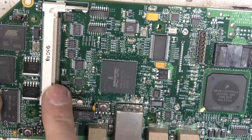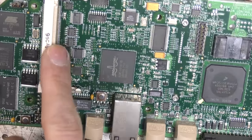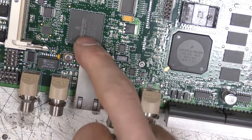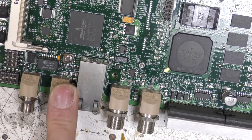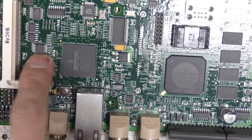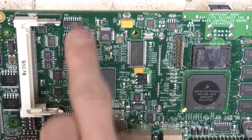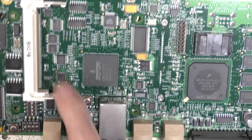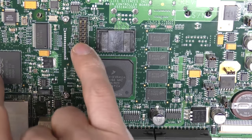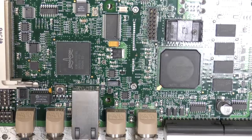There's a connector over here — not sure whether that would be for memory or for some other I/O, as it seems quite a long way from the main processor. There's also an ethernet switch because this unit uses ethernet to talk to the camera, so there's ethernet for the main processor and also for the camera combined through that switch. There's a Max 3232 RS-232 transceiver where I found some debug text, plus a couple of other RS-232 transceivers. I couldn't figure out where one of them was connected — possibly there's a resistor in series somewhere, but there are no other obvious serial debug headers.